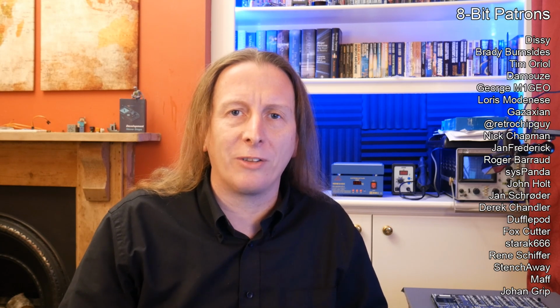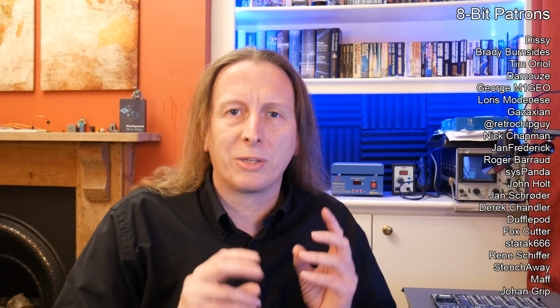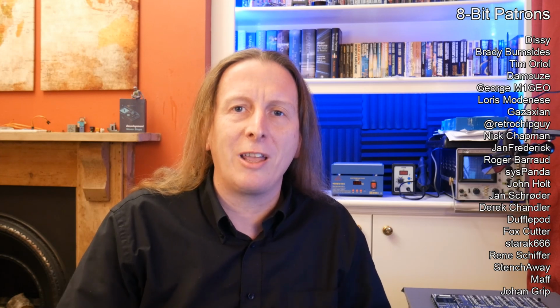Hello and welcome back. In the last I/O video, I interfaced an RTC chip over SPI, and we did that by bit banging. In talking about that, I did briefly touch on the fact that there are 4 different modes of SPI based on all the permutations of the clock polarity and the clock phase. And the RTC chip we used supported 2 out of the 4 possibilities, specifically just one of the phase configurations.